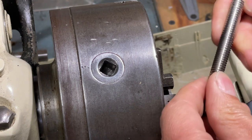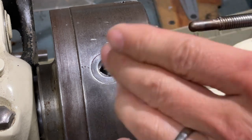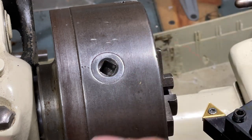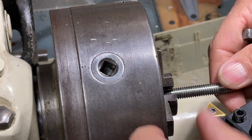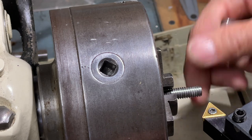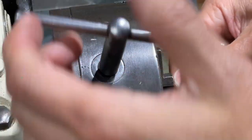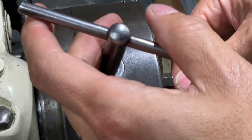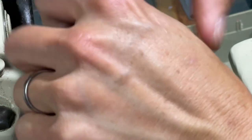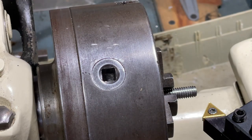I'm going to make just a little rounded end on one end, then thread it back into the cue with this side so it won't have threads at the very bottom. I think there's enough thread engagement that it's probably fine — at least good enough for an initial try. This is an old metal lathe I use for cue work. I'm using a three-jaw chuck. It's a little awkward because the camera's in the way.